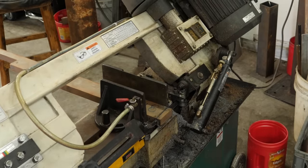This is always my favorite part of doing gold inlay — when you get to sand off the excess gold, get everything cleaned up, and see how your inlay truly looks. I just finished sanding the handle to 600 grit and that 600-grit actually leaves a nice satiny finish on the gold which is going to help it dance around in the light a little bit more. I think it's going to look really good with the 2K finish over it. At this point the handle is completely ready for the 2K finish.